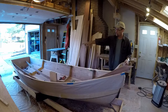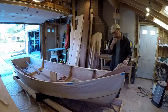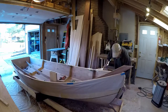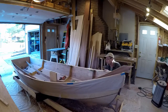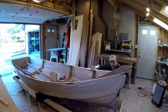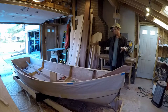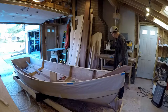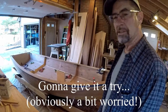I'm still thinking of no-brainer things to do because I'm not really sure how to protect this. So we're gonna mask this off. When we get to gluing on the rail, we'll eventually want to be able to run a bead of epoxy caulking and I don't want any of that on the urethane. So mask it off, leave about an eighth of an inch over the masking tape. I'm kind of leaning toward just gluing this on and seeing if we can force it and screw it into a good enough overhang all the way along.